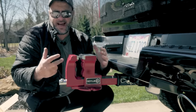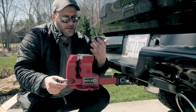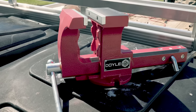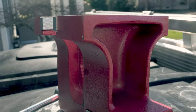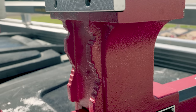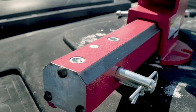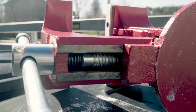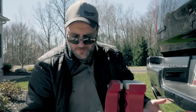Now, a lot of bench top vices are made out of cast iron, so they're good for vicing things down, but when you're pounding on them they could crack — they're not that strong. However, this is where Harbor Freight's really stepping things up. Instead of making this out of regular cast iron, which you would see on a lot of bench top vices, they made this of 60,000 PSI ductile iron. If you don't know what ductile iron is — instead of regular cast iron, which is more brittle and able to break or bust if you take a hammer to it, they mixed the iron with other metals such as magnesium to make it stronger. So instead of being real brittle and just cracking when you hit it with a hammer, it would more likely dent — the metal would move around a little bit instead of just splitting off.